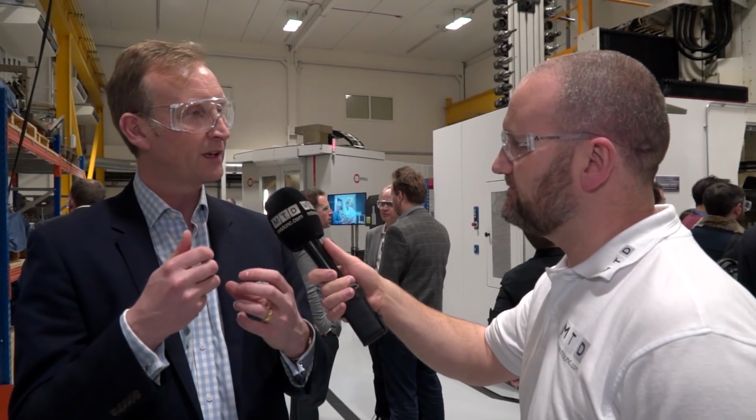What we're able to do is automatically convert just those regions of the toolpath which we need in 5-axis to enable us to get access, and leave the rest of the toolpath in 3-axis. We're doing it automatically in the software without the user having to do any real work at all. Is that PowerMill? That's in PowerMill in the 2019 version of the product, which is just being released now.